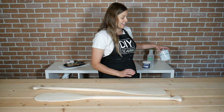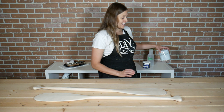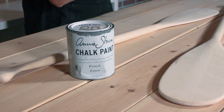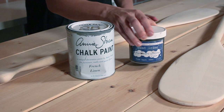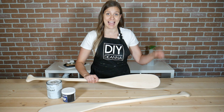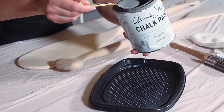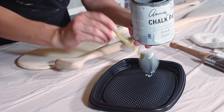I'm going to be working with chalk paint in a medium gray color — this is called French linen — as well as a water-based stain and glaze in a cool brown tone. If you wanted a really rough look you could start by beating up the wood a bit using hammers and nails to create dents and dings, but I'm going to skip that step on this one and get right to applying the products.